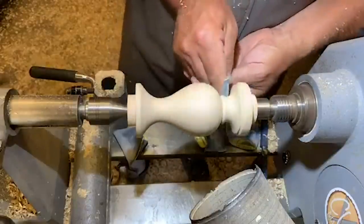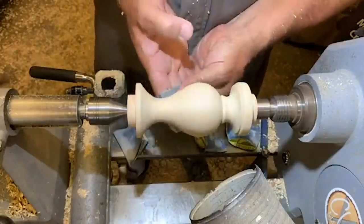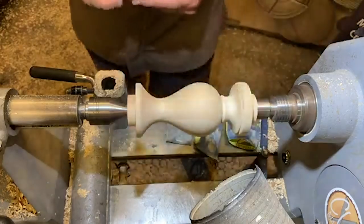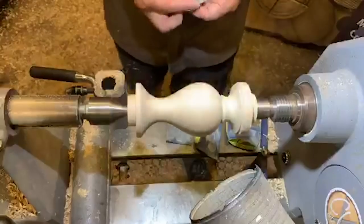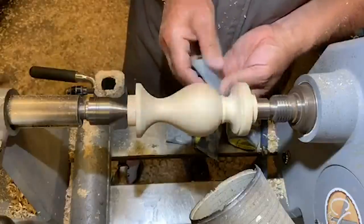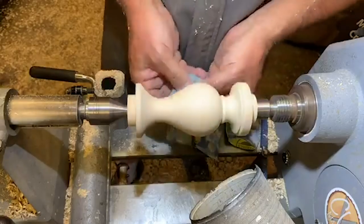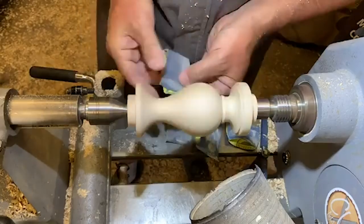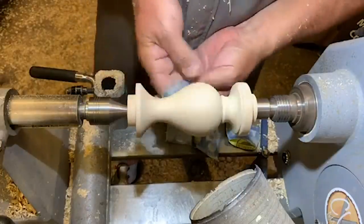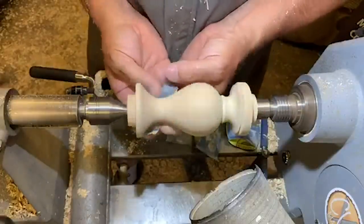Yes. And if you're looking at a good quality abrasive, then you're going to be fine. On the lathe, I tend to prefer material backed abrasives. I just find that they last a lot longer, they're more flexible. If you're buying really cheap paper abrasive, then the paper will break down before the grit runs out. So the grit is still cutting, but most of the time it would have fallen off and dropped to the floor. So I would always spend a bit of time and a bit of money on abrasive.